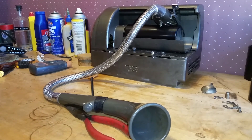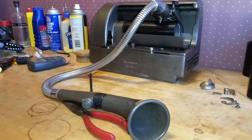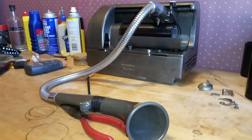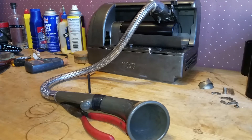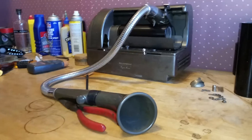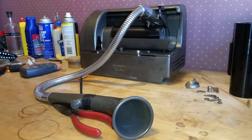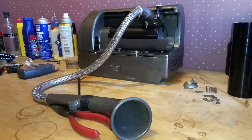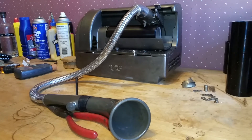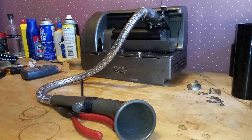I pulled off some of the extraneous parts that I don't need — the bell at the end of the travel, one of the springs, and a bunch of parts off the back. For what I'm using this for as a cylinder phonograph, I'm not really concerned with all the parts that made it a dictation machine. I am going to leave the speaking tube on it simply because it has the push button, and the push button works. But I've also repaired the manual trip lever, so I can record without holding the button down if I want to.